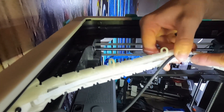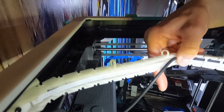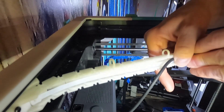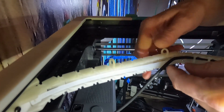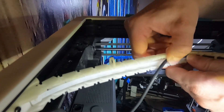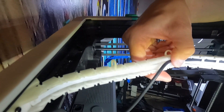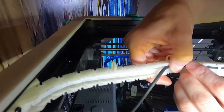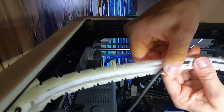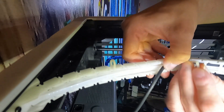Basically guys, what you want to do is make sure you route the cable from the head of the printer along the cable chain so that you have some slack at the end at the back of the printer. The first time I didn't do that and I had to reopen it and redo it. Also, I put too many cable links in.